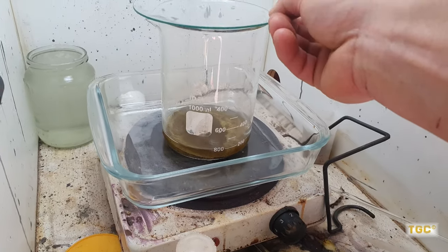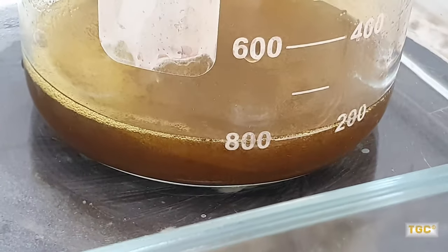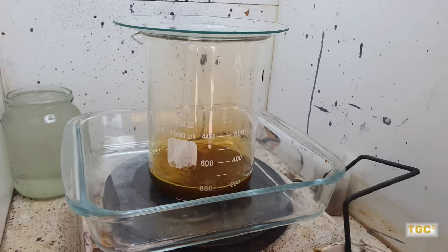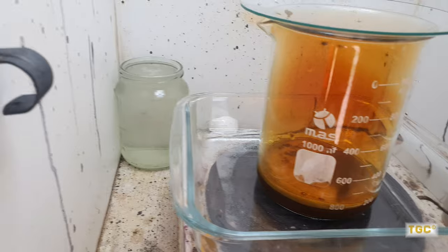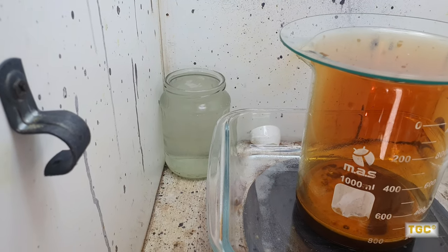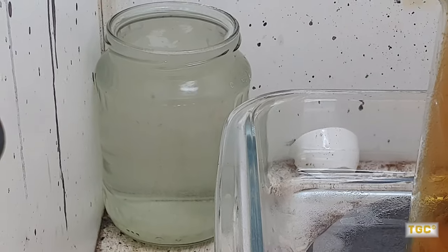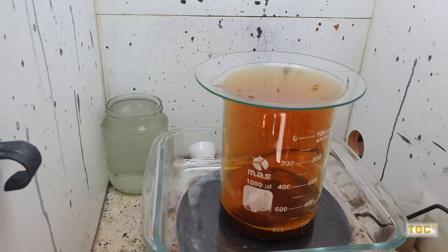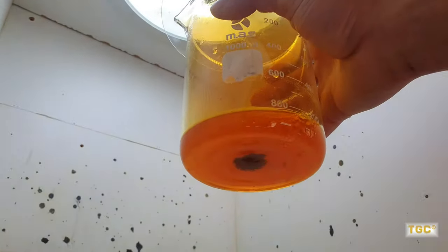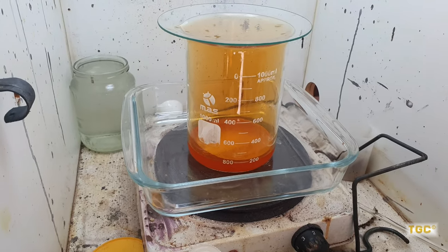There's about seven and a half millilitres — watch her go. Beautiful. It's taken off really well, and just to confirm also that the stannous chloride that I made using an old pewter mug and some hydrochloric acid did work correctly. I've added some more sodium metabisulfite to that waste solution from before and you can see the SO2 gas still bubbling away but nothing precipitating out of the solution. So that's good news — stannous chloride worked and we got all the gold out of the solution. It's been less than five minutes — most of the gold's already gone. The second refine always goes so much quicker because you're actually dealing with nearly pure elemental gold.